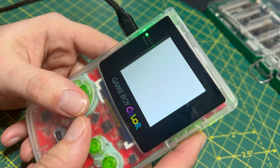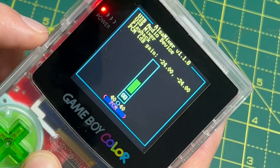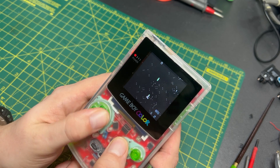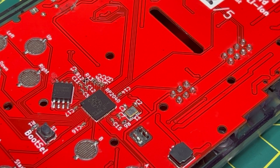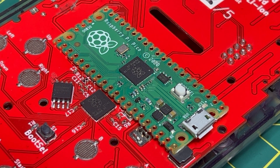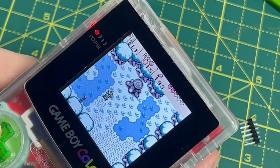The status light is now polychromatic, next to a dimmable backlit screen that you can adjust with the volume wheel, which also controls the volume. This tight integration with the Game Boy's controls would be really complicated with just a Raspberry Pi Zero. So with the Same Boy, you're actually performing a double brain transplant. This little chip here, baked right onto the motherboard, is an RP2040 — the same chip at the heart of a Raspberry Pi Pico. It's literally here as a second brain: a USB-connected, fully programmable microcontroller that handles all of the physical user interface.